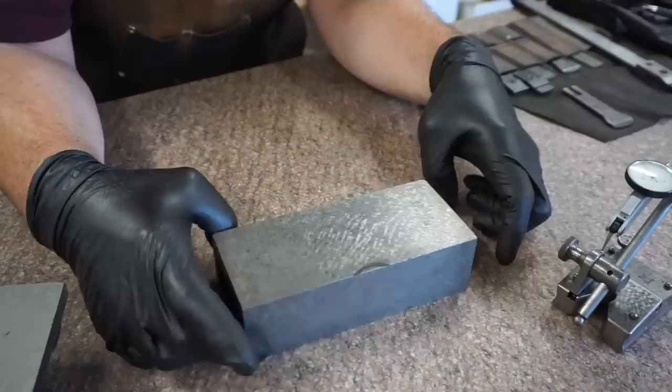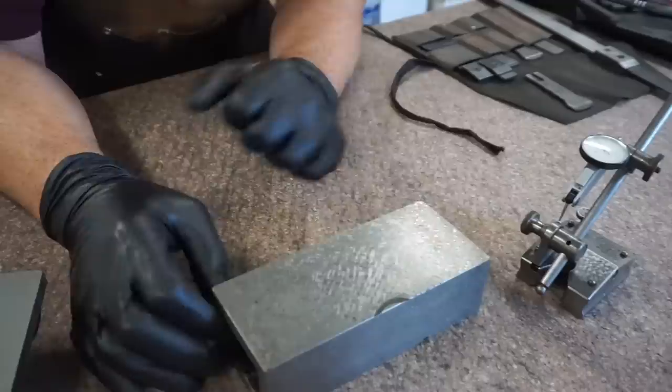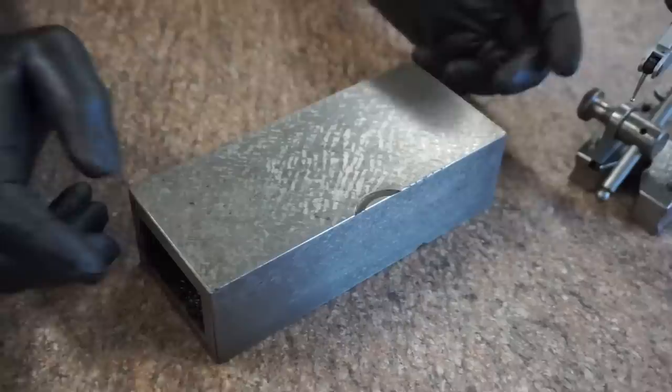And if you've seen me on Instagram, I did a little quickie on my stones. If they're flat and mastered to a good granite, and you hinge them, the center rotation should be about 30% in from each end. And this is subjective, but these will be your hinge points on a flat surface.